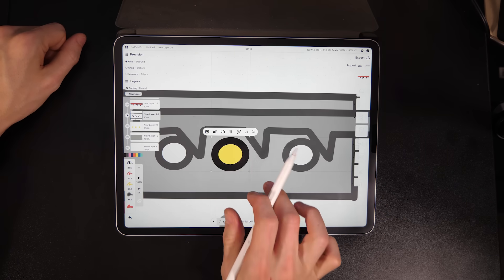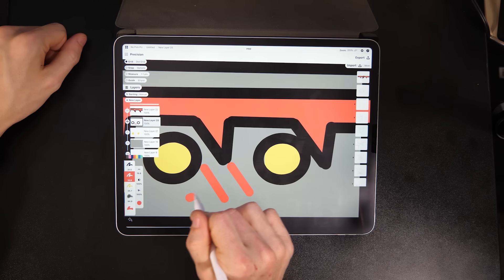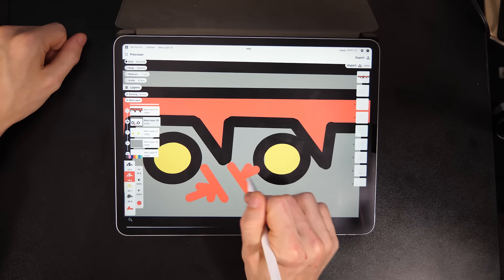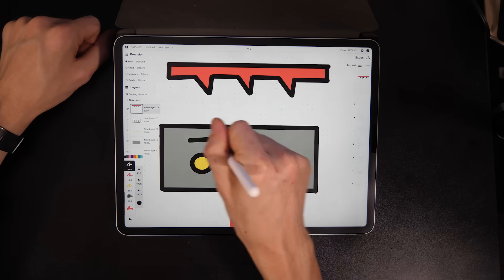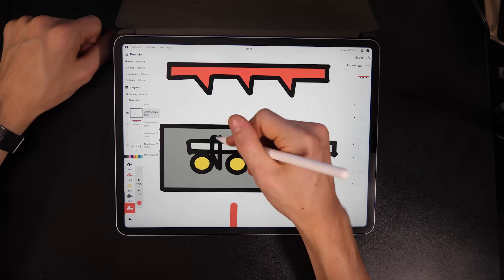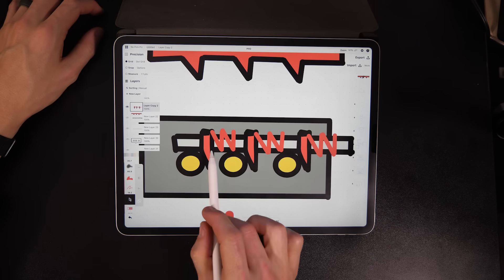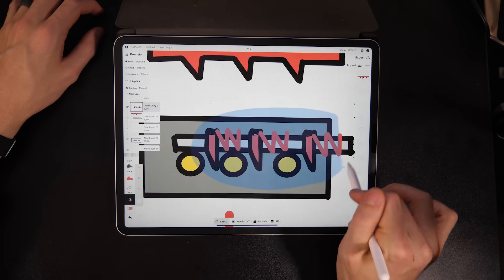If things aren't the exact perfect size, it'll hit one pin before it hits another and never touch the others, so some pins won't get locked. What I've been attempting to make is a system where each little finger that can lock a pin is floating on a spring. That way each one can individually compress different amounts, and I can guarantee that they all make contact.